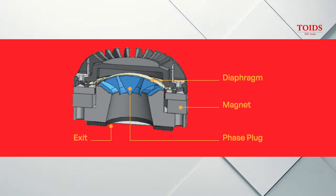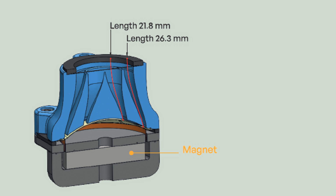The main difference is that we turned it inside out. Normally the energy comes off the concave side of the dome, through a phase plug, out to your ears. But then you have to put the magnet structure on the back, outside the coil, and that's what makes the compression driver big. So instead we said: what if we put the magnet structure inside the center? In the core there's an N52H-grade neo magnet — super high temperature — that's the magnetic gap, and the coil sits right inside. The whole magnetic structure fits inside the center.